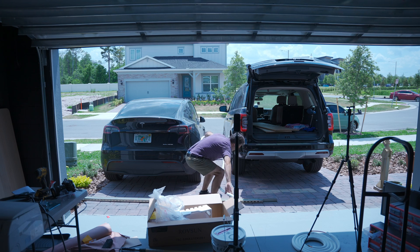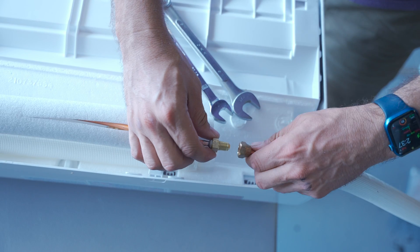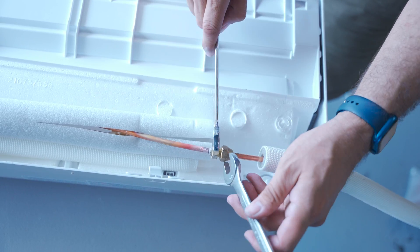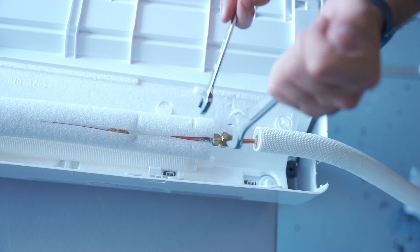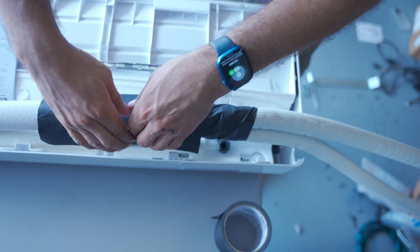With those wires connected, you're almost ready to connect the inside part to the outside part. But first you need to straighten out these insulated copper lines — they're sort of delicate, because if you bend copper too many times it will eventually crack. So try to do this just once. With those lines straightened, flip your indoor heat exchanger on its back and hook up those lines. They only fit in the correct way so you can't screw this up — there's a big one and a small one. If you buy this same unit, the nuts on the thinner line are 9/16ths and 11/16ths; the bigger one is 11/16ths and an adjustable wrench. Get those things good and tight — there's a page in the manual for the actual torque figures, which you should use. Then tape up the insulation — I used black gaff tape, but either way it's better to close these things up than not at all.